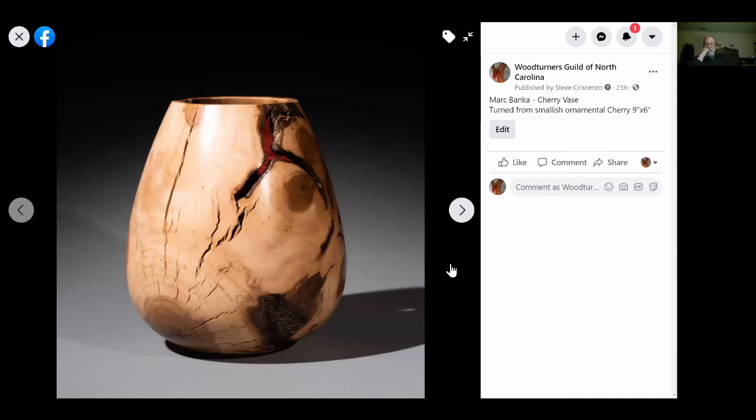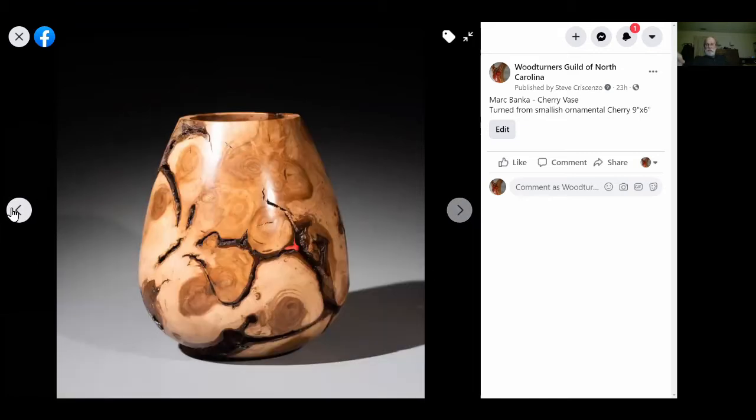Yes, you can see on the back side, whichever that is on that bottom left corner, if that was facing up or facing down, that looks like a root to me, I suppose. But anyway, the hollowing was really interesting because of all the different densities of wood and the extreme cracking that I had. And I'm not that good at hollowing. I just don't have a lot of experience at it. So I had a Trent Bosch stabilizer that I was using, and really found that just wouldn't work at all.